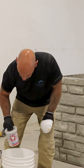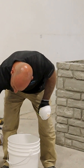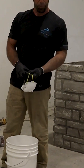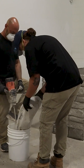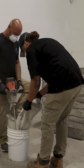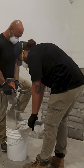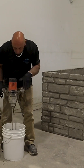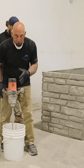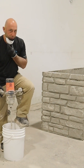What I normally do is two and a half pints to a quarter of a bag of panel mix. Even though this is just panel mix for patching, you still want to mix it for three minutes so you get all those properties to blend nicely. That's the goal — three minutes. Don't cheat yourself because you'll pay for it later with cracking.